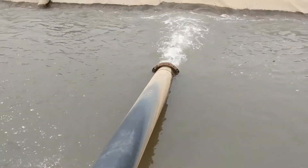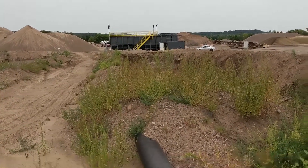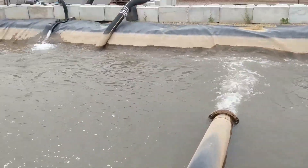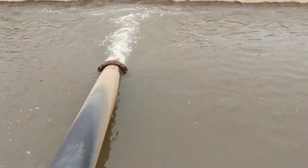Here's the clean water pond. This is the gravity discharge from the clarifier itself — about 2,500 gallons per minute of good clean water. They've got two clean water pumps they can run independently, one for each wash plant. We're maintaining a really nice clean water for these guys. I can see probably 18 inches to two feet into this water, so we know from experience this water is well below 30 NTU — certainly good enough to wash.